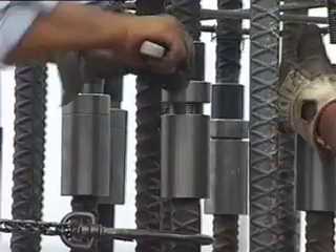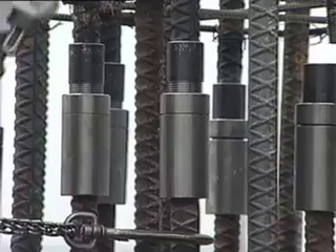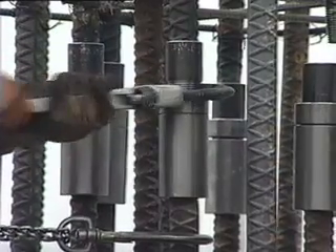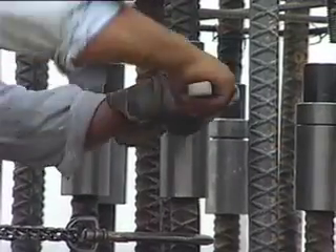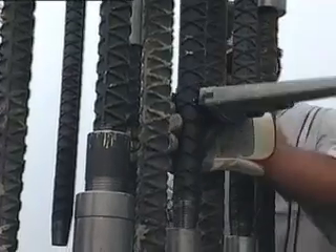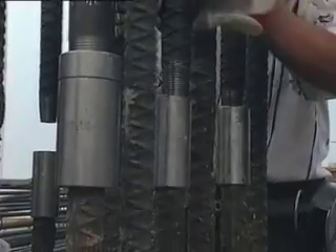It's a very quick system. For even faster cage placement of either complete or skeleton cages, you can use Lenton position couplers on the four corners. Fly the cage into place and get the four corner position couplers threaded down. Then you can safely cut the crane loose while your crew finishes tying the cage into place.